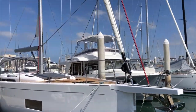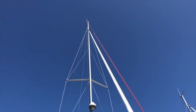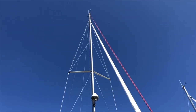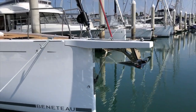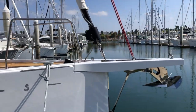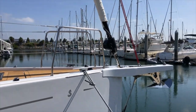There's a two-to-one halyard here, and at the top of the mast there's a chafe sleeve about 15 feet so that when you hoist a code zero up there, the halyard is protected as it goes through the sheaves if you're sailing with the code zero or spinnaker for a long period of time. Just after that is an electric furler, which is an option from the Beneteau factory.